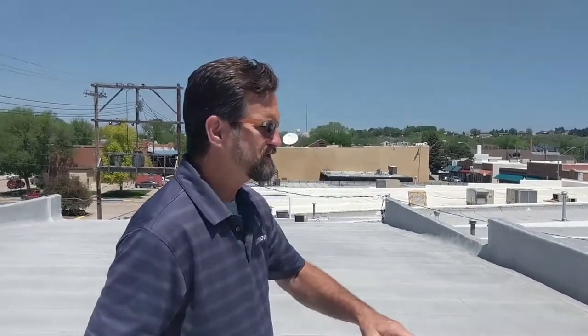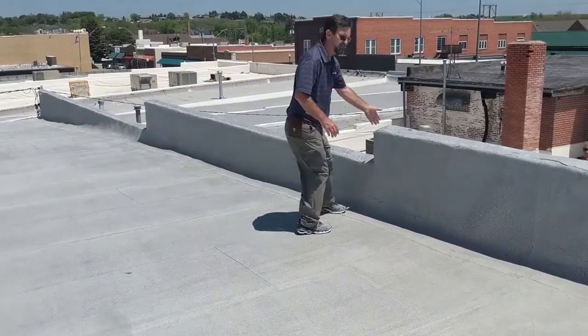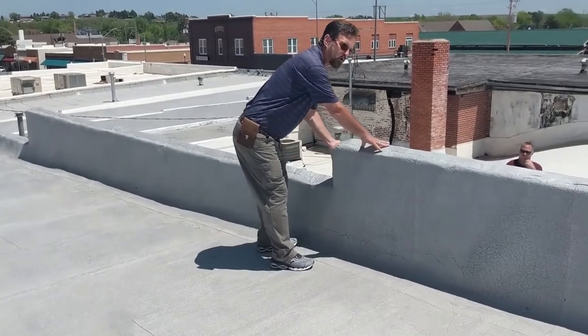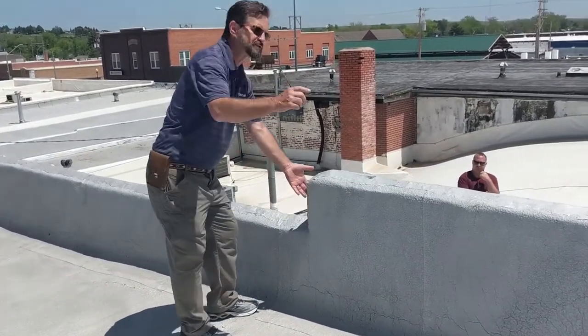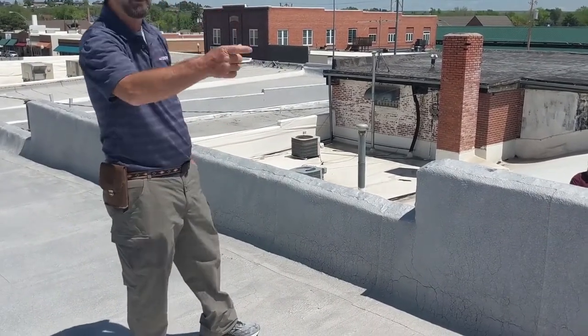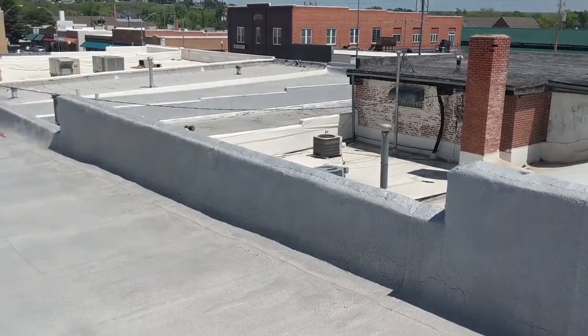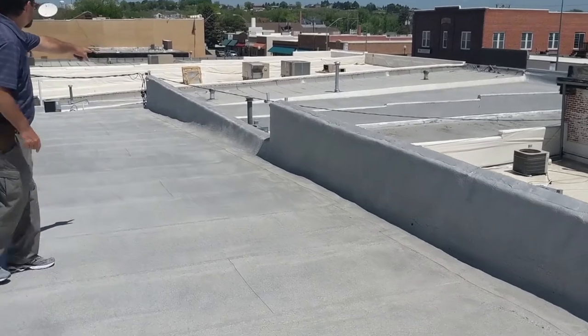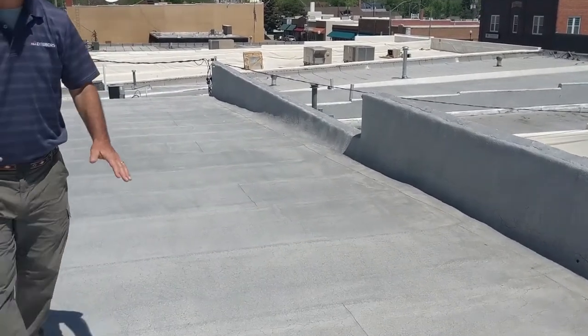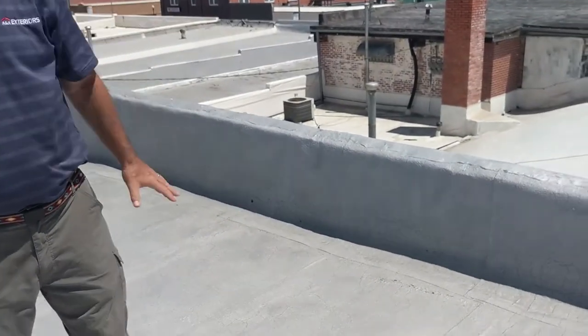One thing I forgot to add to this roof is that if you look at it, it's got a really strong pitch. You can tell your pitch by these drops. So these walls should be horizontal. And you can look at the drops and you can see pretty quick, this is at least a half 12 pitch. So it probably runs 20 feet with a 1 foot drop. And I can see that in these drops. Now, it even drops more seriously down here. So this could be a full 1:12, I suspect it is. With a 1:12 pitch, that is great drainage. Water will really move.